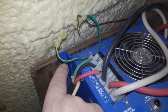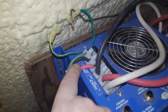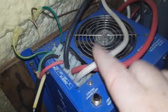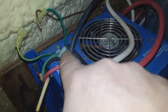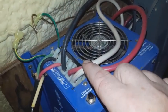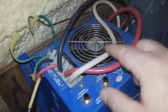The generator has a bonded ground outside. This ground goes out there, hot leg 1, hot leg 2 coming in. So you've got 120 volt, 120 volt, and we have a neutral wire. Why is there a neutral wire? Because at any point in time, this 120 or this 120 in a 120 application needs a return. And that's what the neutral does. It sends the power back.